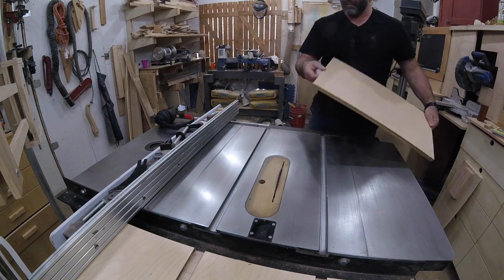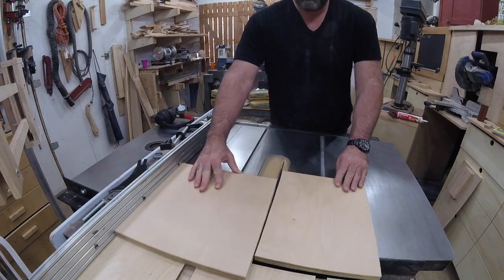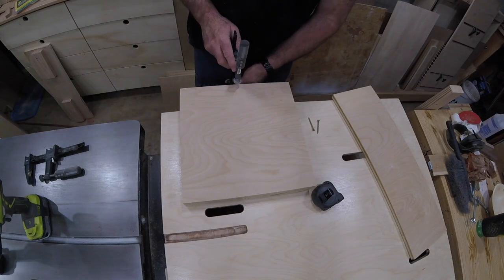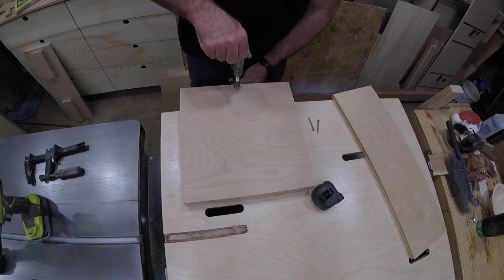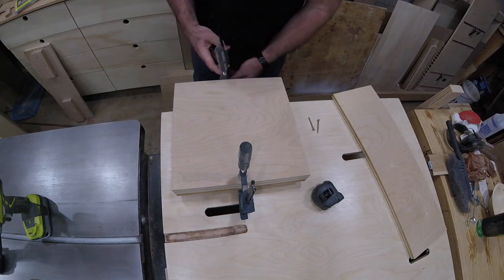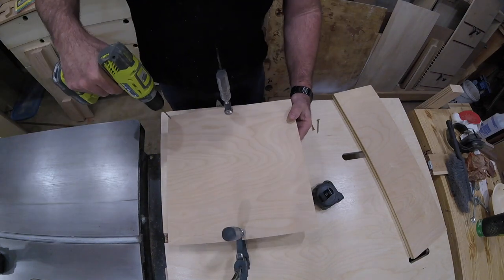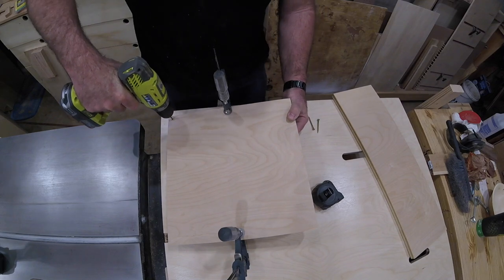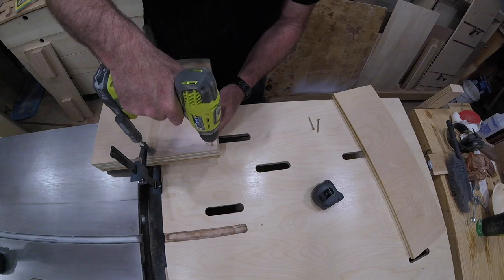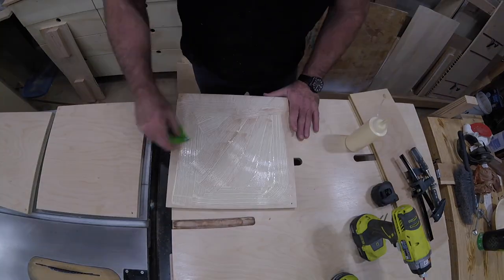First I'm cutting three pieces of three-quarter inch plywood to around 14 inches square so I can true it up later. After gluing the plywood together so it will remain flat for a long time, I clamp the pieces together and pre-drill holes for screws in opposite corners so the glue-up is very easy.